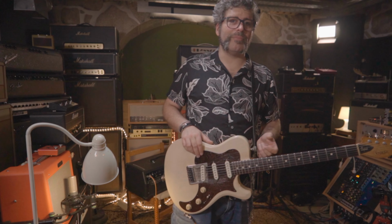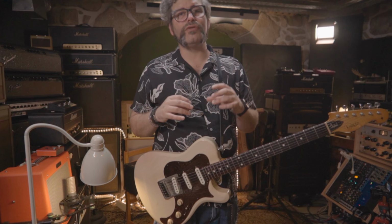So for those of you who don't know, an amp is made out of power tubes and preamp tubes, or valves, as they say. Power tubes are the ones that give you the power, of course, so the rating, the wattage, like a 22 watt amp, or a 15 watt amp, or a 12 watt amp, or a 100 watt amp, that power comes from the power tubes, the big tubes inside. The preamp tubes are the ones used for reverb, for raising your guitar volume up, for EQ, and usually that's that. Some amps, like my Mesa Boogies, have a tube effect loop, but that's a different thing.